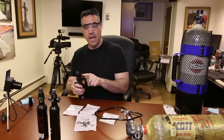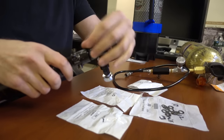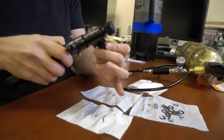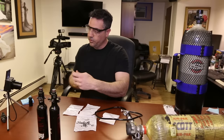You can't remove the slide check without first releasing the air that's in the top portion. If you try, it'll bust off. So push the slide check back and forth to let the air out slowly, then you can unscrew it safely.